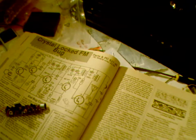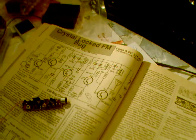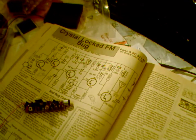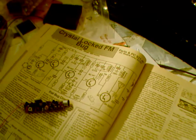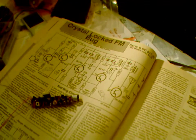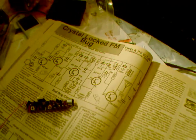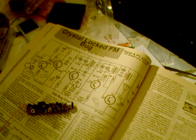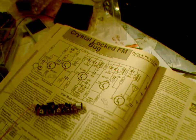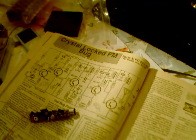But self-building variable capacitors, it's much easier if it's a fixed type variable capacitor. I did a video on a home station magnetic loop that uses coaxial cable as a capacitor, where most of the capacitance is fixed, using RG213 coax, but a small part of the capacitance is variable, where I make something out of overlapping printed circuit board material, and that allows you to vary the range by around 100 kilohertz within the band. So that is a possibility.